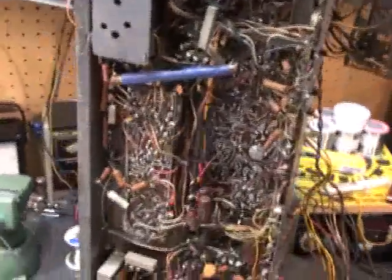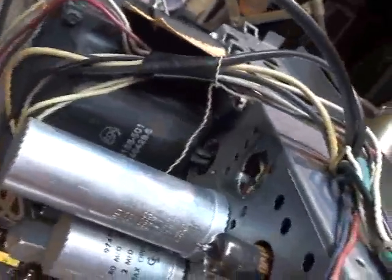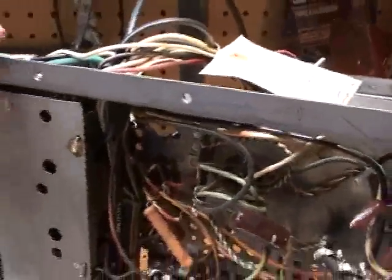Leonard was the last name of the people that owned the set — I was able to confirm that with a little bit of research. I had a bad electrolytic capacitor, as you can see — I pulled it out of the chassis and the electrolyte had kind of leaked out of the bottom. It made a little bit of a mess in the cabinet, but hardly anything.